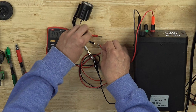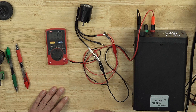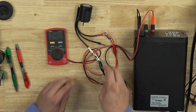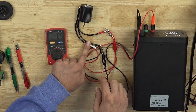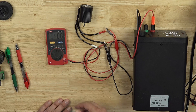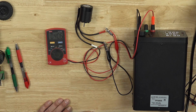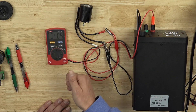I'm going to switch phases. A little higher — that one's 40. We're going to switch phases once more. That one's about 40. So we had one phase that was a little lower than the rest, but this one's 40. Now if we let it sit, it will actually start generating heat and we will see the resistance climbing. But one amp really isn't enough current to change that significantly.